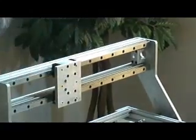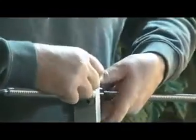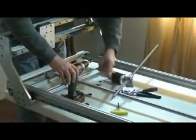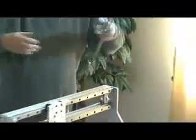Now we're going to put the Y screw in. That takes this bearing, ball screw support right here. And you use four number 10s, they're 7/8 inch long. Two bearings, 5/16 bearings, and 2 5/16 nuts.